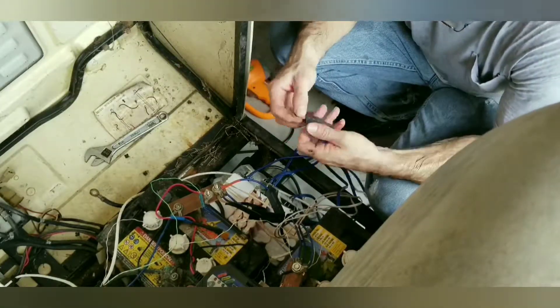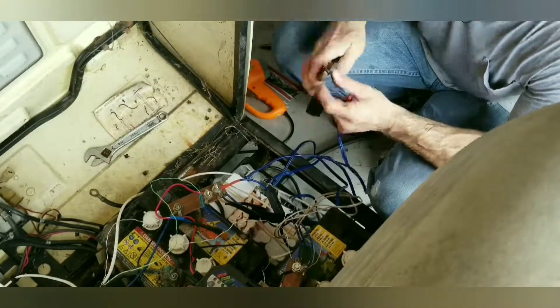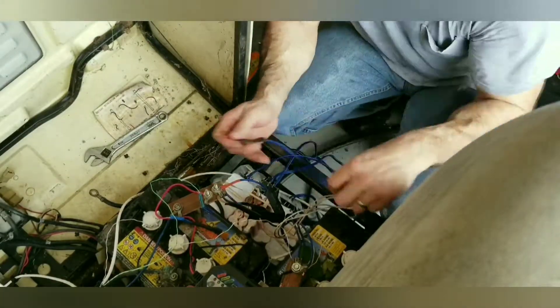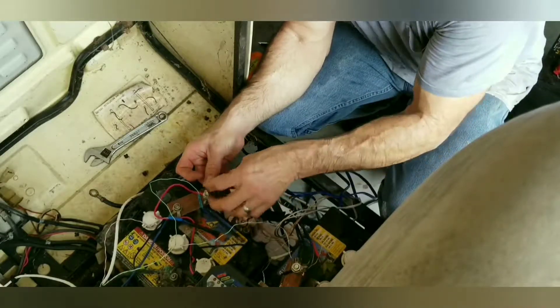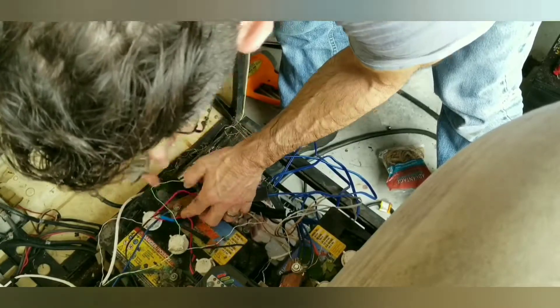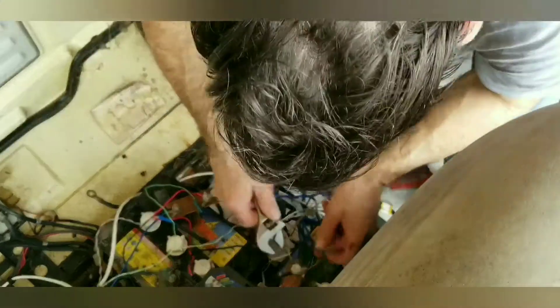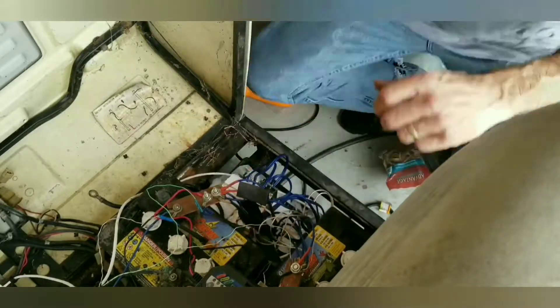Now what you see me doing here, I'm putting some heat shrink on there. These are bare terminal ends that I'm putting on there, and one of the problems I've had is vibration has caused the wire to break. And when that wire breaks, if I've crimped onto the insulation, the insulation will still be there but it'll look like the wire's connected and it's not — then I'll have one pack that's electrically disconnected from the rest of it. So far this is working. I put those packs in there. That top one that's not even shrink-wrapped, that's sort of an experimental pack to do other stuff with.